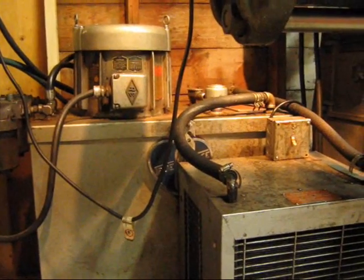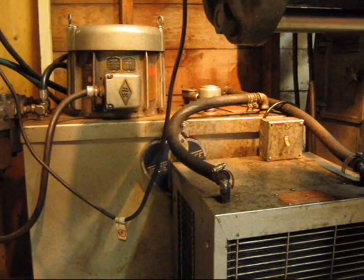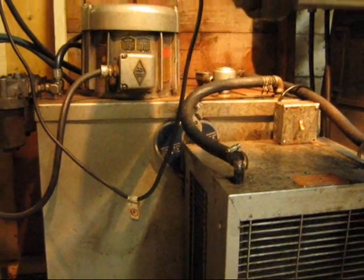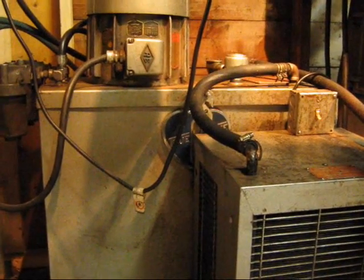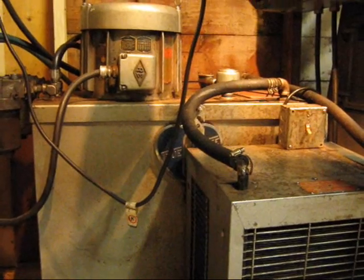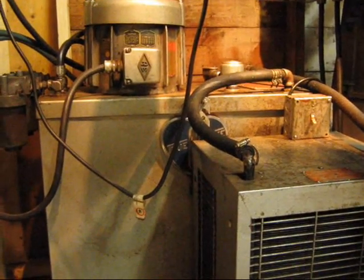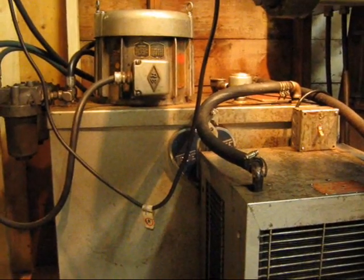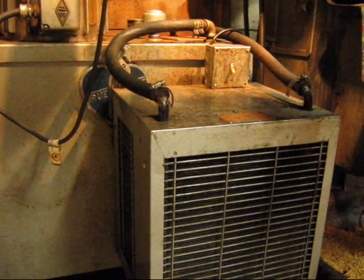This is the hydraulic system. It's got a five horsepower hydraulic pump on it and a large tank below. The True Trace emblem that you can see kind of in the middle here. It's got a little sight glass to measure your fluid level of the reservoir — reservoir is about forty-five gallons of a mixture of hydraulic fluid.